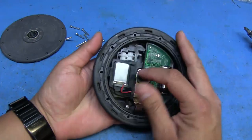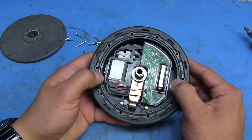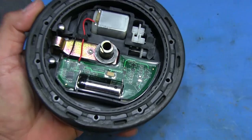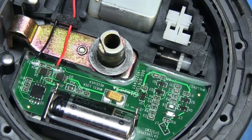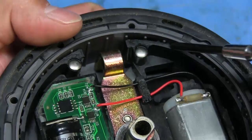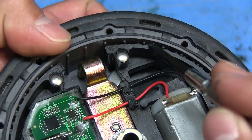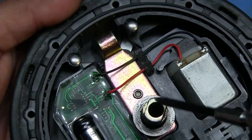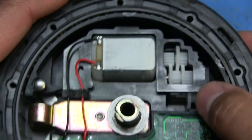The bearing's mounted on each one of the sides here, and then this center hub just comes up. It's actually locked right now — at some point somebody was pushing it out and it locked. It looks like it's got a motor here, with some gear reduction, and you can see it in there — it's got a worm drive. This piece right here, this whole ring that goes around, has these little teeth and grooves, and then the outside of the wheel has these little notches. So what it looks like happens is that this pushes up against that and locks the center hub with the rest of the wheel.